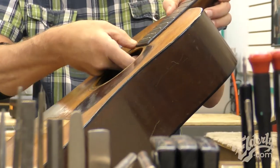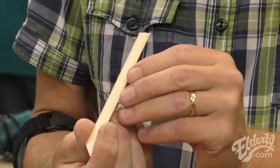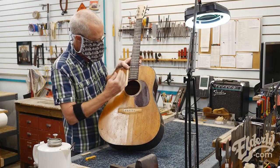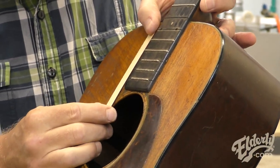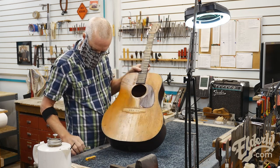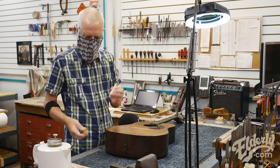What I've done is I have a cleat with a 45-degree angled grain, so when I put it in there, that grain will sit like that. The grain on the top is running like this, and that 45 degrees goes against it to add some structure to that area.